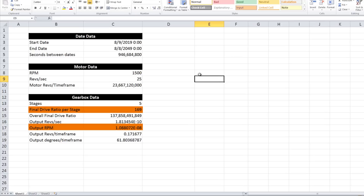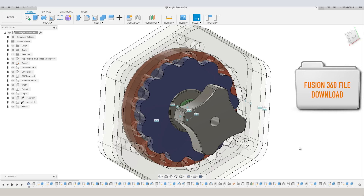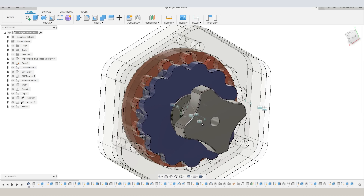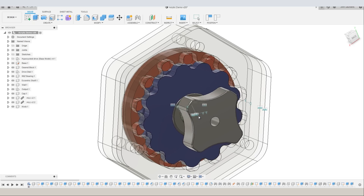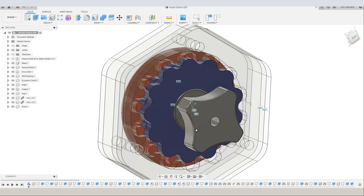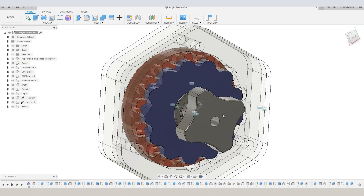The first Fusion model that we built — we'll share this on the NYC CNC page for folks who want to be building robots or higher-torque output mechanisms with this design — is again just awesome to look at. You can rotate this knob and watch as the eccentric shaft rotates around and interfaces with the red output shaft. You can start to get a feel of just what that reduction looks like, slowly watching that red output shaft rotate as I'm turning this knob.